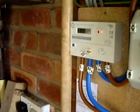My trusty Carlo Gavazzi AC controller has a 10 volt analog signal which comes out of the Arduino times 2, and a 24 volt AC supply. This is simply routing power up to the immersion heater. It routes whole cycles on a 64 cycle window in a distributed whole cycle zero-crossing mode. At the moment we're on something between quarter and a half power, with 1600 watts coming in and we're exporting.